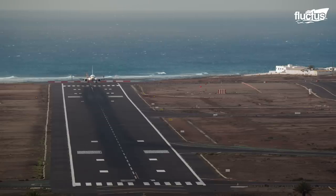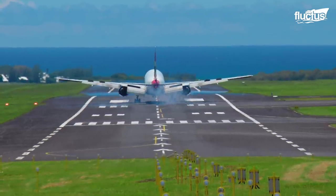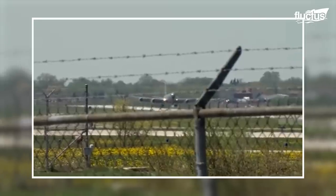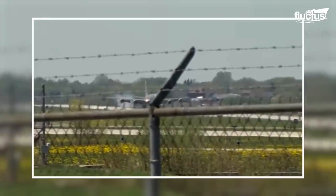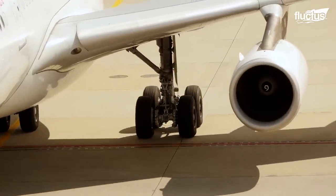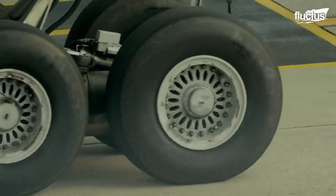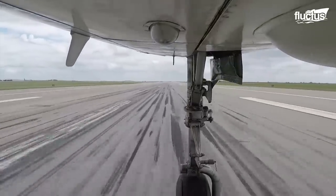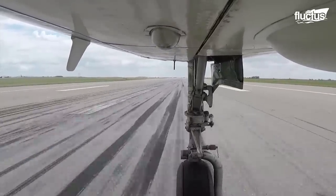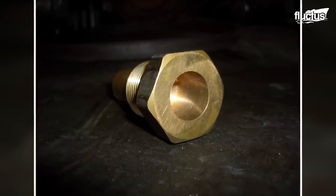When most aircraft hit the runway, the sudden rotation causes the peak temperature on their tire tread to reach 400 degrees Celsius and even more. This causes overheating in the aircraft tires, which are mostly composed of rubber and nylon fabrics with critical temperatures of just over 200 degrees Celsius. To keep the tire from exploding or catching fire when the wheels get too hot, fuse plugs or thermal plugs are mounted inside the wheel hub when they are manufactured.